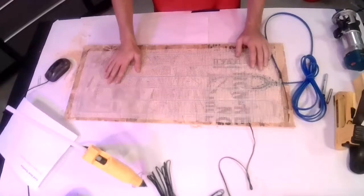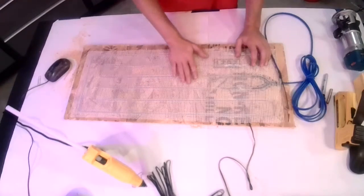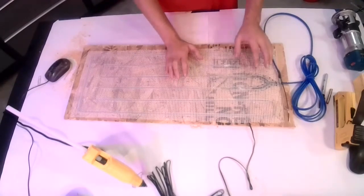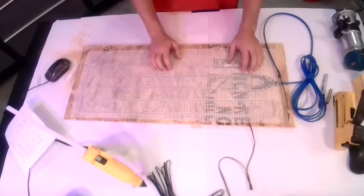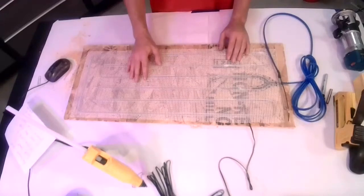Question here, do you need a vapor barrier? So for Gold Heat, you do not, because you're going direct down over the subfloor and putting the tile on top of it, and it's all adhered together. There can be a little bit different methods if you're not going directly over a wood subfloor like this. You can install it over other subfloors. There are a little bit different methods,